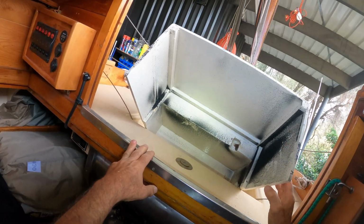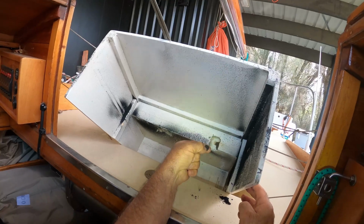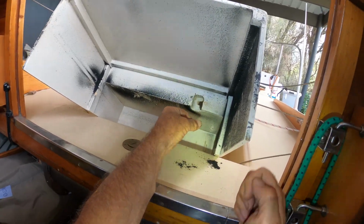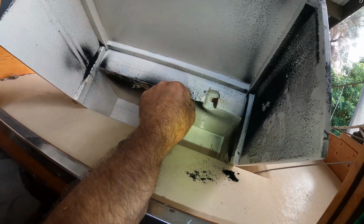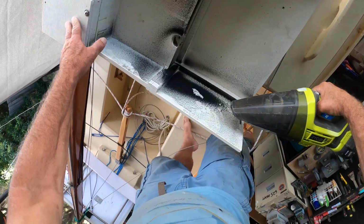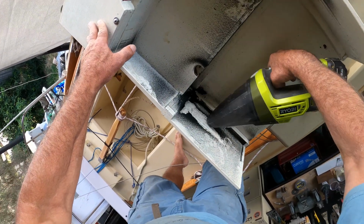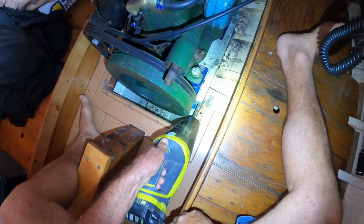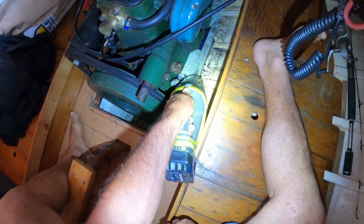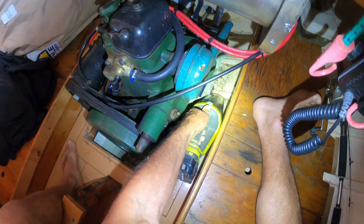Oh, now check that out. I think that could explain why the belts are slipping. Seems that it's very difficult to get good old-fashioned V-belts. You can only get the notched kind. The ones that I've got are a bit long, so it's at its maximum extension, and that means that they were slipping a little bit, and hence the rubber everywhere.